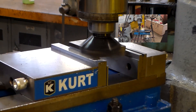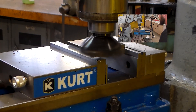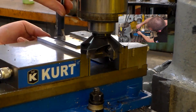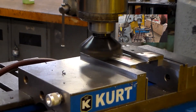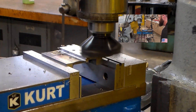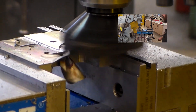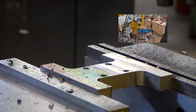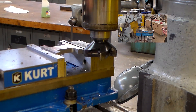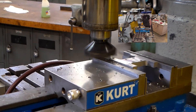Now I'm cutting the hat off. I'm taking a sort of CNC-type approach, and people were doing this kind of stuff before CNC machines. Not getting too carried away with my depth of cuts — the R8 taper in a Bridgeport spindle with a three-inch face mill with 90-degree shoulder insert design cuts pretty hard, so I'm just letting it tell me what it wants. As I break through it's paper thin. I milled down to 480 depth since I had a half inch sticking above the jaw surface. Now I can take some lighter cuts to get my finished measurement.